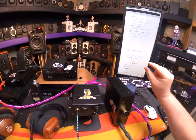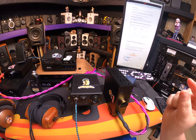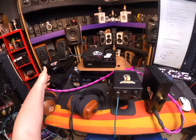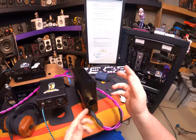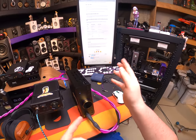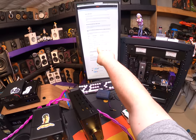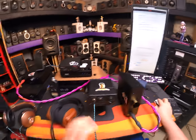It gains a little bit of power. At 32 ohms it's 2100 milliwatts versus 2000 — so a tenth of a watt more powerful. At 300 ohms it goes from 278 milliwatts to 281 milliwatts, so nothing really to write home about.